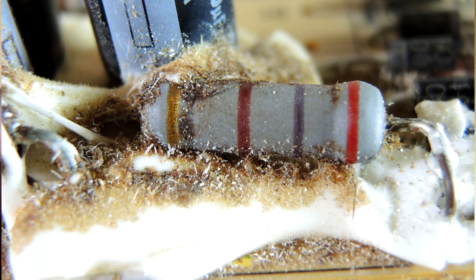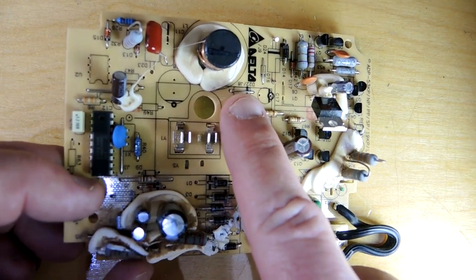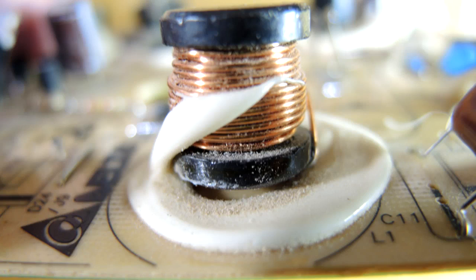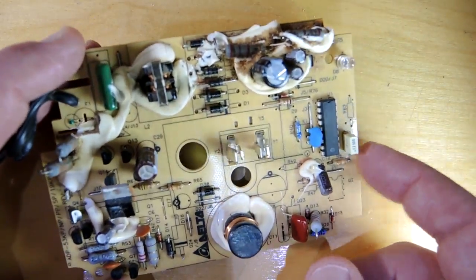The other issue is a big theme I'm seeing a lot: even though the assembly design might be good, it's often let down by poor execution. Look at this inductor here — this epoxy is supposed to hold this part on, but it's just been swiped around by a finger or a nozzle, leaving only the barest whiff of adhesive holding the choke down. In high-volume manufacturing you often get let down by what appears to be pretty sloppy assembly work.